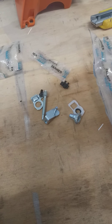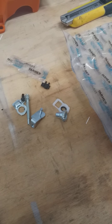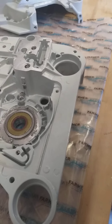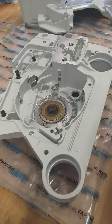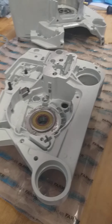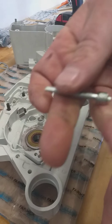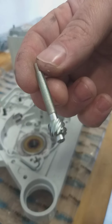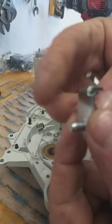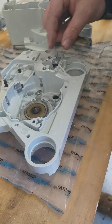We're going to open up the package for the chain bar tensioner - that's all the parts there and we're going to fit it here. My son's going to hold the video camera so I can use two hands. The first part we've got is the thrust plate, which is this little black doohickey here, and that's going to go against the worm drive screw. We've also got the actual bar tensioner itself, which is going to sit in there and ride on that.